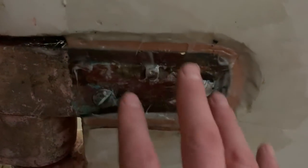For tonight I finished, I already filled up this gap. After that I will use this type of material, the PVC, to fill up this gap, and after that I will fair with epoxy fairing. In this case you can see here I use the PVC so I don't use too much epoxy fairing, because it's possible to crack. In this way it's very flexible and no water enters.